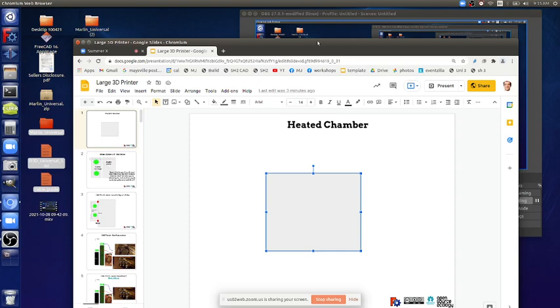And this is once again the case for the high temperature printer, because we can't print with anything but PLA. But if you can print with, for example, polycarbonate, that melting temperature is much higher. The glass transition is like 147 as opposed to like 60 for PLA. So you get like 80 degrees C more, above boiling. You're going to be good above boiling, so you'll be pretty good in that part.